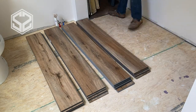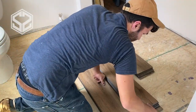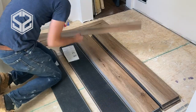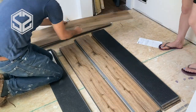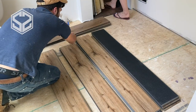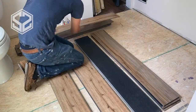Now one thing to keep in mind before you just start laying the flooring — it's recommended that you mix up the packs of flooring that you purchase. If they are from different batches, the coloring can change slightly, so you want to mix that in randomly so that you won't have any odd transitions from one color to the other. So I'm just going to take all of these and combine them into one stack that I can pull from to lay down the flooring.